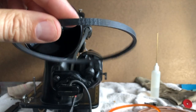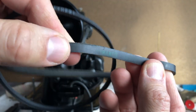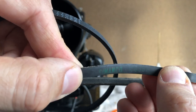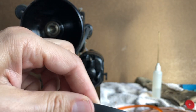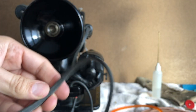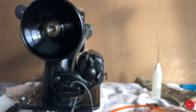This is a modern recreation of the original Singer belts. And I think I have one here — this is the old one. It says Simanco on it — Singer Manufacturing Company. This one is actually not in terrible shape, but when I'm overhauling a machine, unless I can tell the belt was replaced recently, I normally will replace the belt. This one still has some life in it, but I wanted to go ahead and get a replacement for the new owner.